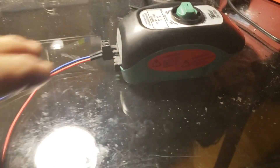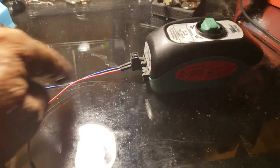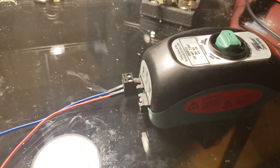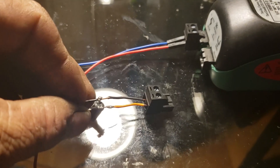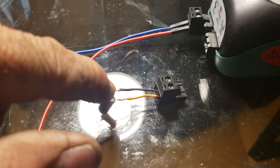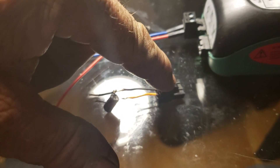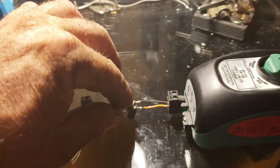What I'm thinking is, external to this thing, I could just put another rectifier in series to convert it to DC before it even goes in. And sure enough, it still works. What I've done just for a test is soldered in a diode for half-wave rectification to a capacitor, so it's now going to be about 24 to 25 volts DC going into the device instead of AC. I'm thinking I can filter the power externally by charging this capacitor.